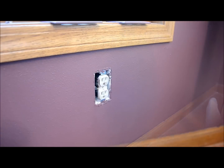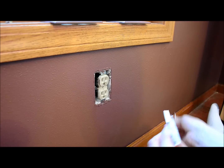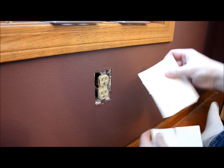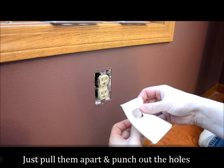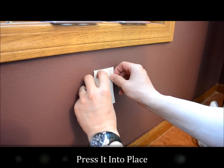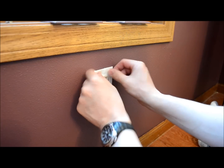So let's put this thing together. Installing the electric outlet and switch sealers — this is fire-retardant plastic foam. We'll use the one that suits our needs here. Punch out the outlet cover and you're going to see it just fits right over that very nicely, like a wool sweater, and that will block all that cold air from coming in.